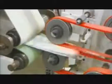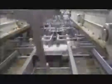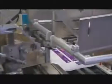Conveyor belts relay the folded diapers to a carousel. Finger paddles separate them and position them for packaging. Sensors count the diapers as they move towards compression arms that squeeze the required number together. A pusher swoops in to slide the diapers into a bag, vacuum arms open the bags right on cue, and hot bars seal the package full of diapers.